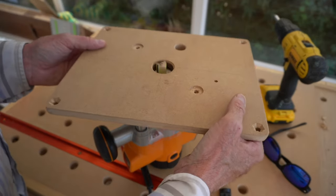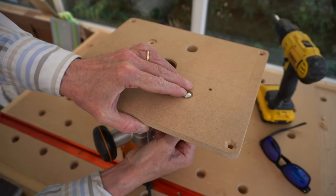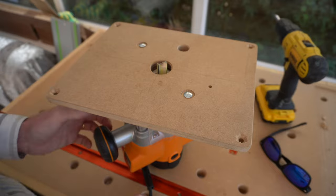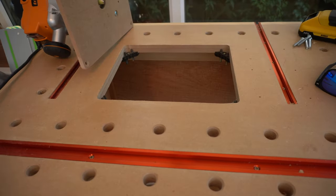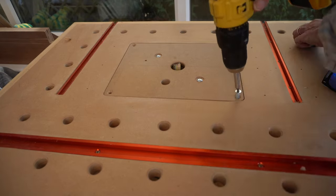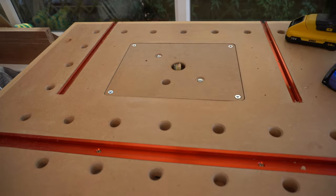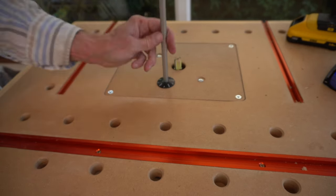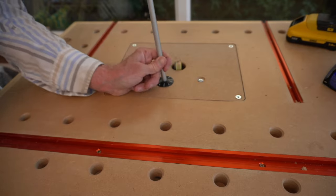I can now mount the plate on the base of the router. As I said previously, these two bolts are part of the mounting kit that comes with this router. The router mounted into its new plate is dropped into the hole and leveled on the Craig levelers, then firmly fixed in place with the supplied bolts. The height of the router can now be adjusted with the spindle supplied with the router. The spindle for the JOF is slightly shorter and a little less unwieldy than the one for the larger router.